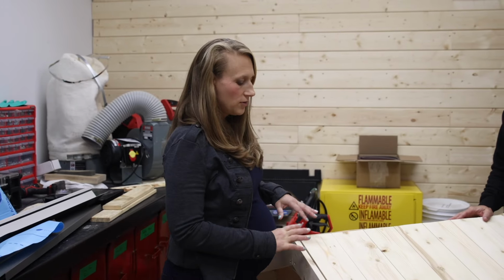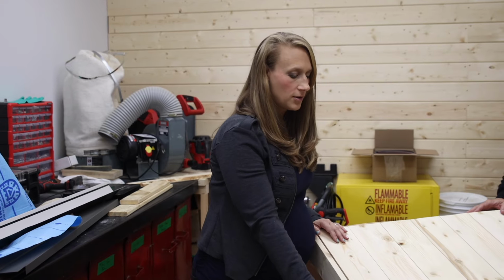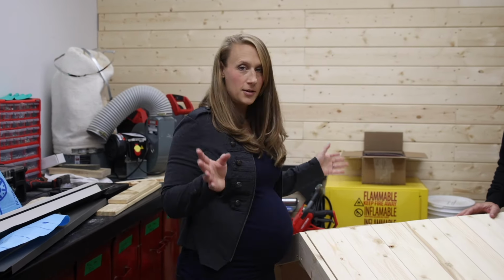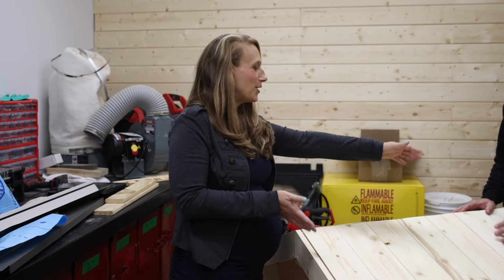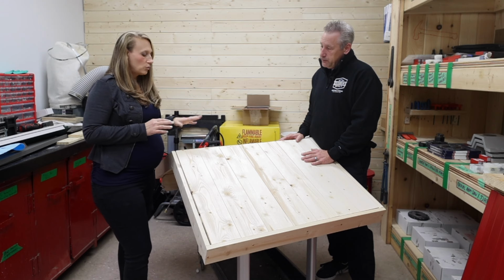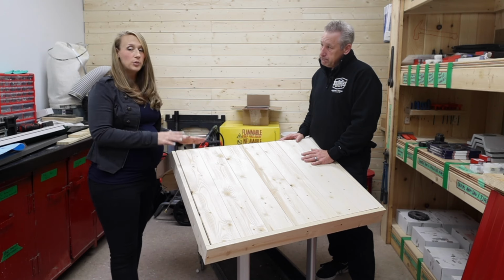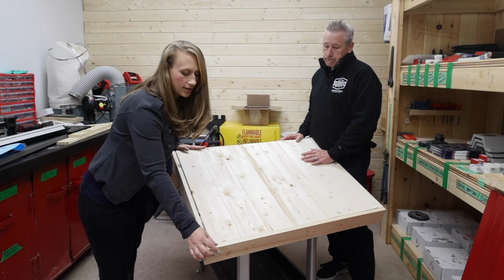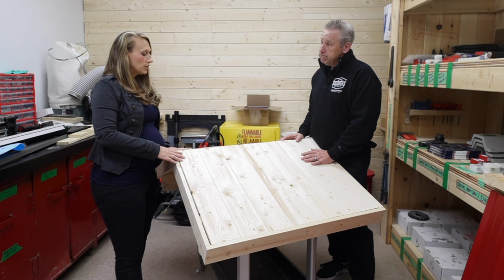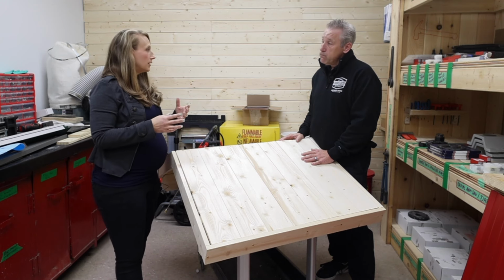Okay, so we've gone over everything with the strapping, the eave and gable ends, and now we're on to the main pièce de résistance. We're on to the metal panels themselves. Number one in importance in terms of how you place that panel is that you get a good inch overhang so that we get a proper drip off. So let's talk about the panels and how to install and work with them.